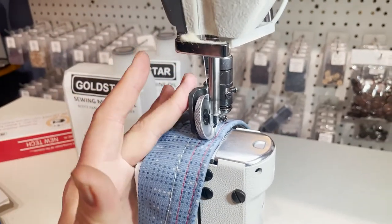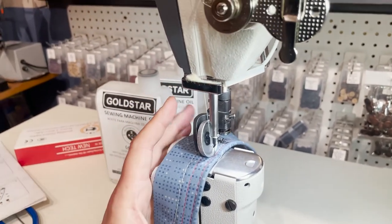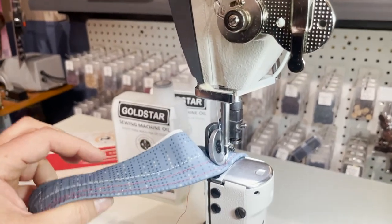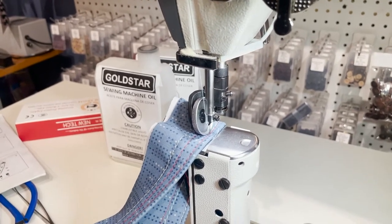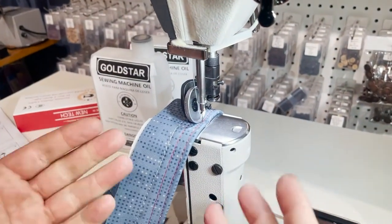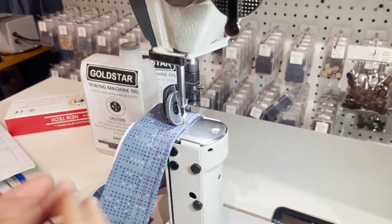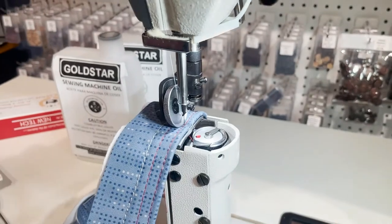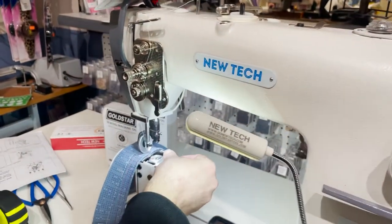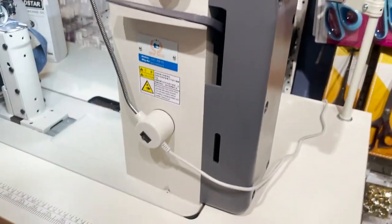People ask: can we change this foot for any other type? No — this is the only foot you can use on this machine: the rolling foot made for this type of machine. It's great for patch makers, shoe makers, hat makers, bag makers — anything that has to sit in here. It's a beautiful machine. It's not a walking foot, not a needle feed — it's a regular industrial sewing machine. Bobbin goes right here — no bobbin catch. Pop the lever up, take the bobbin out. Buy a bunch of them. 203470 is your bobbin, 135 by 17 is your needle. Use regular white neutral 100 oil.